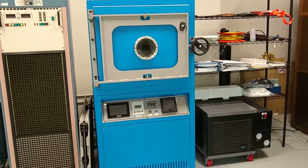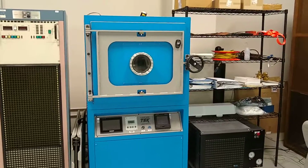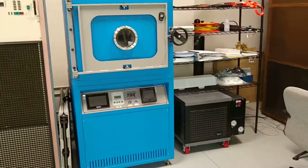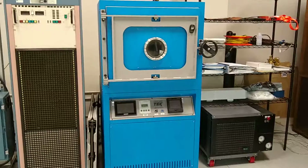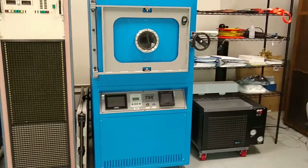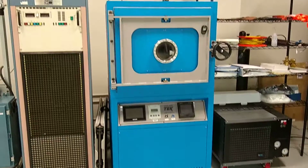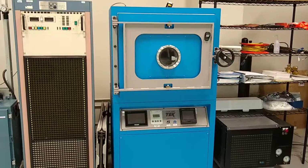Now, the second thing of this chamber, it looks like a TARDIS, right, is that we can heat up the satellite from one side and cool it down from the other side. Because when you are in orbit, not only is there no air pressure, but there is also heat, right? You heat up the satellite from one side, from the sun, and on the other side, well, you cool into 3 Kelvin into space, right? So you have thermal stress on the satellite as well. And what this means is that with this thermal stress, parts on the satellite age really, really quickly. And we can simulate this with our thermal vacuum chamber. We can simulate basically 1 year in orbit by 10 days, having a component for 10 days in this thermal vacuum chamber.